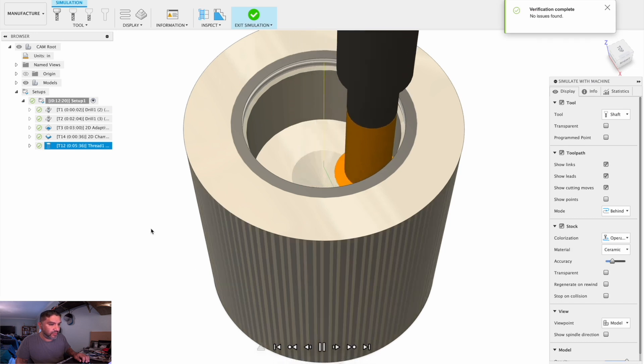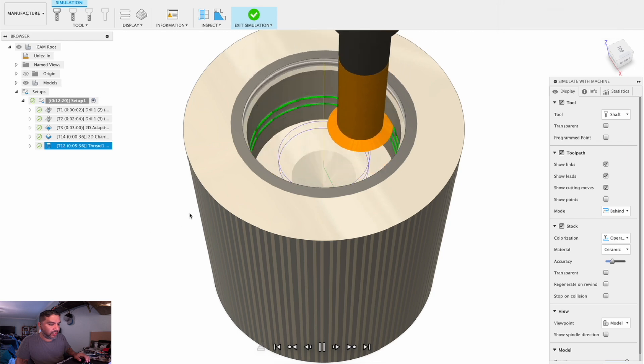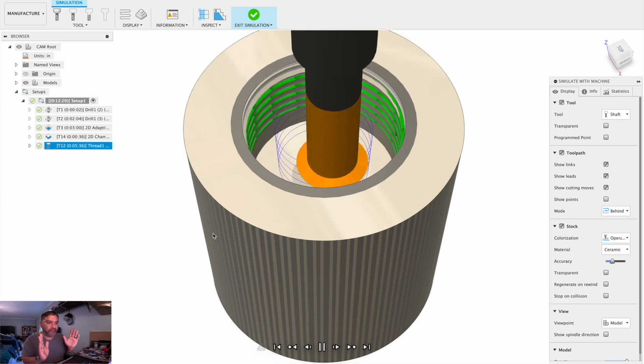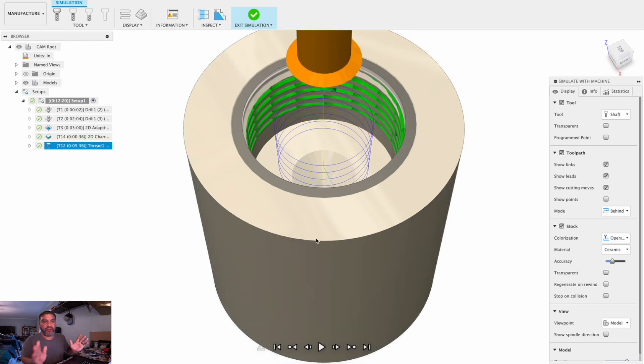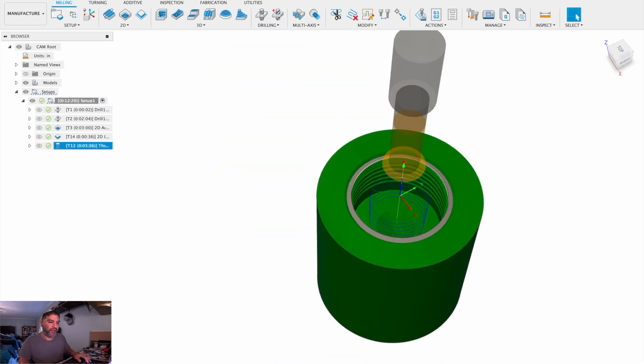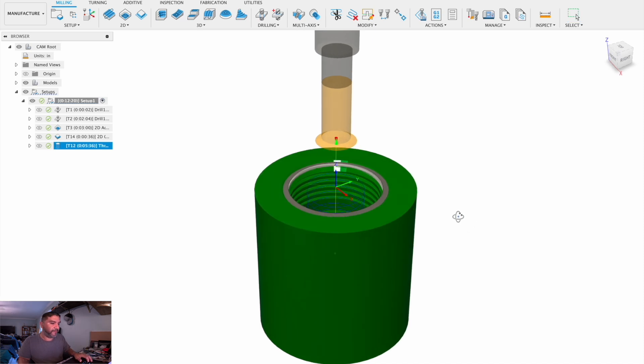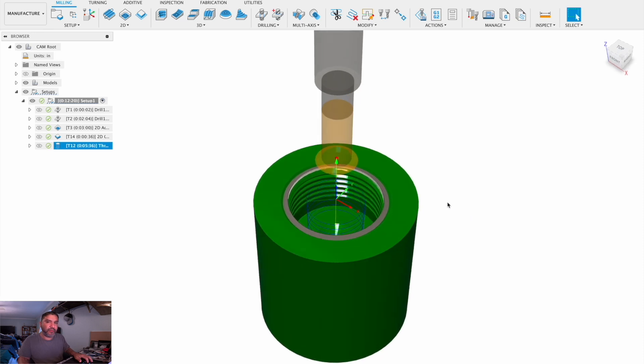And it goes in a little more. The key to this is telling Fusion that it's a tapered hole to begin with. If not, you're just going to get a straight hole — even if you have a tapered end mill, it won't matter. If you do it with a tapered end mill on a straight hole, your code would just be a straight line straight down, not NPT. If that was useful, like and subscribe; let me know if you want a different subject — leave that in the comments and have a good day.